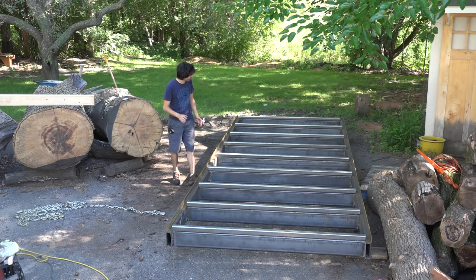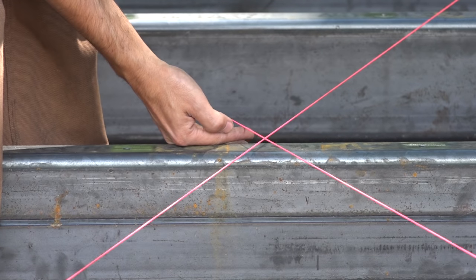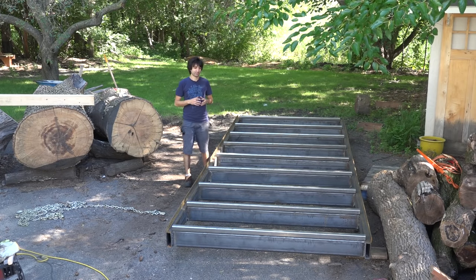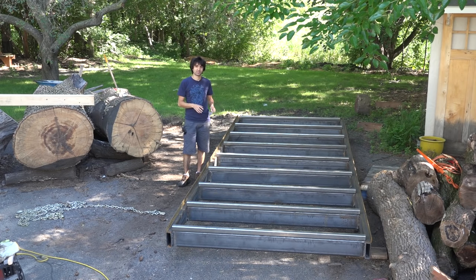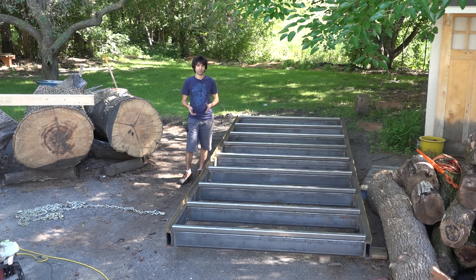I'm really happy right now. I took those braces off, ran my strings back on there, and this frame is exactly as flat as it was before I started welding — I am just thrilled about that. I went ahead and laid the stainless steel runners and tracks on the sides just to get an idea of how this thing is going to look when it's totally done. We're getting really close to being done with the track. A few people asked about pads for the leveling feet — I found some three-inch diameter stainless steel by three-inch thick circles at the steel yard's off-cuts bin, which will be the pads underneath the leveling feet, set up on some blocks of wood for more ground clearance.